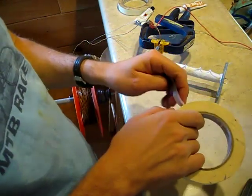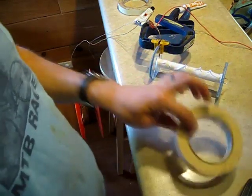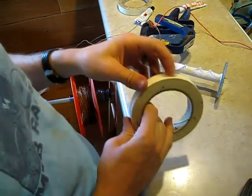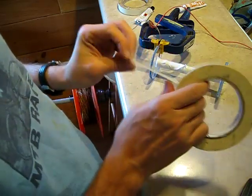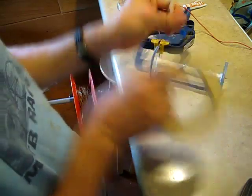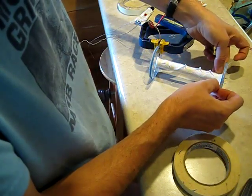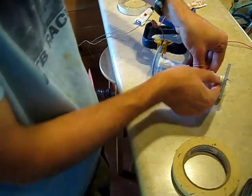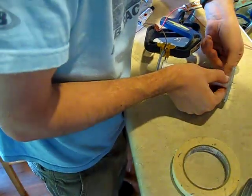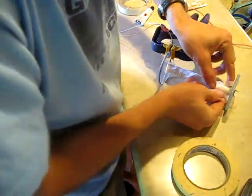I'm going to try something new on this coil that I have not done on any of my others. I've had trouble as I wind over the cotton with the cotton sliding back because of the tension in the windings. So I'm going to take a piece of masking tape, put it here at the very end piece, and really wrap it on there tight. That's going to hold down this cotton covering and keep it from sliding back.